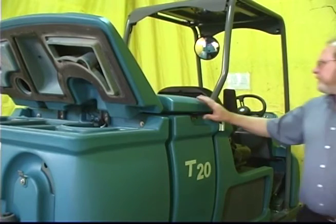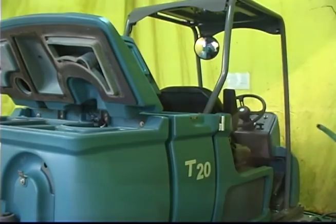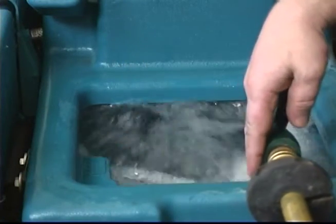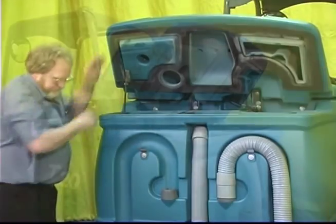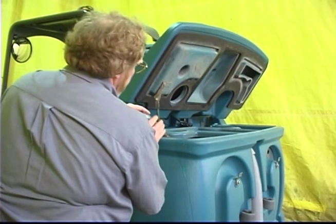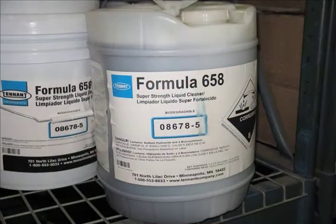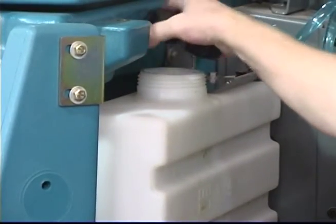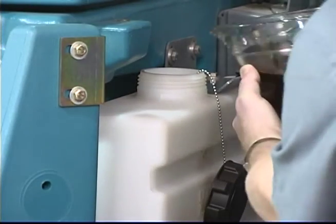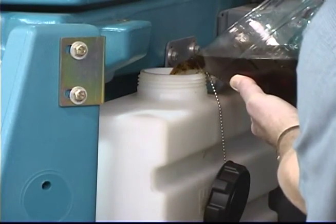If you're not using the autofill system, open either the left and/or right solution tank fill cover and completely fill the solution tank with water. Open the recovery tank cover and fill the recovery tank with water until the tank is about half full. Note: if not using the ES system, do not add water to the recovery tank. Fill the detergent tank with the recommended detergent. Attention: for ES scrubbing, only use the recommended cleaning detergents in your machine. Machine damage due to improper detergent usage will void the manufacturer's warranty and cause unsatisfactory cleaning results.